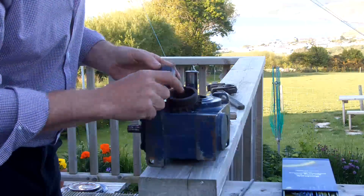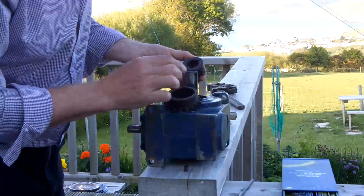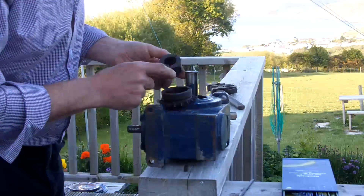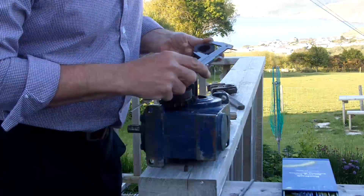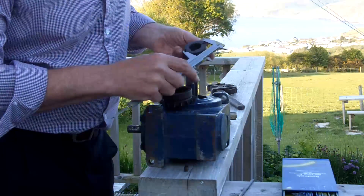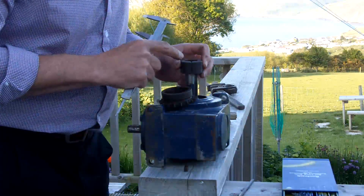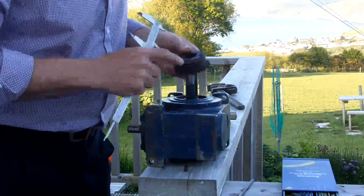These will all be hardened parts, so they'll be quite a high Rockwell hardness, so if I want to turn those down at all I'm going to have to anneal them first. I've measured the internal diameter of the shaft on the bottom of the mast and it's 41 millimeters. This shaft — the outside at the smallest part is 44 millimeters. So I can either have something welded onto here or simply make something else — I need to think about that.